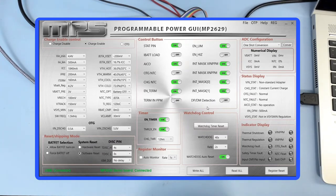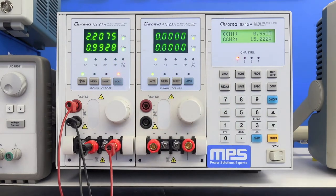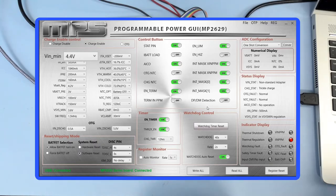Let's add one amp to our load box and turn on the load. Now I'm going to adjust the V-IN minimum voltage to be above the 5 volt input. The MP2629 will disconnect from the output because we are below the input voltage required.